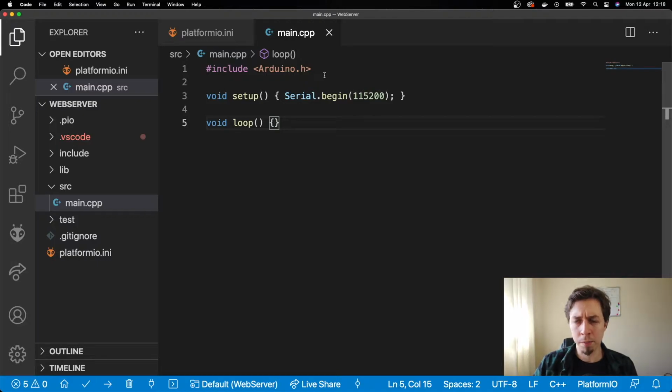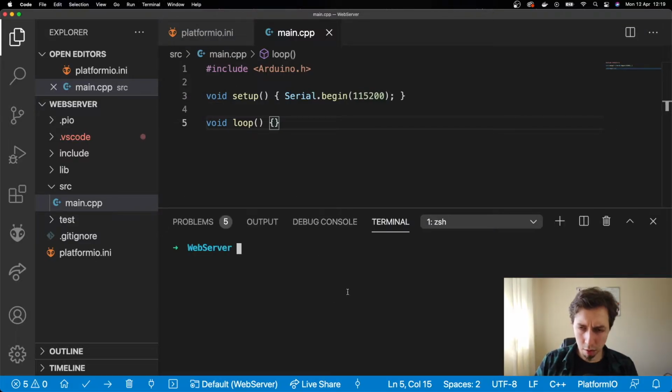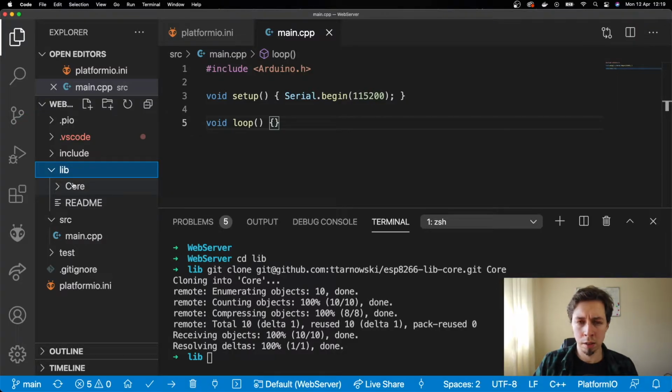And to connect to Wi-Fi, I'm gonna use my own library. Let me just quickly clone it. You can find the link to the GitHub of the library in the description of this video. But essentially what I need to do is to go to the lib folder and then just run git clone into a core directory. So that's going to automatically create a core directory inside the lib directory, the directory for the internal libraries. Okay, so I've got this done.